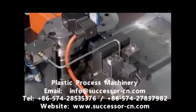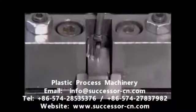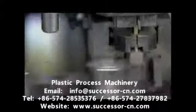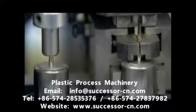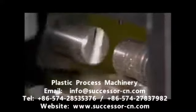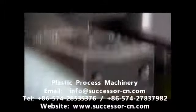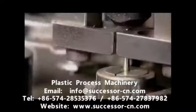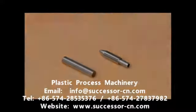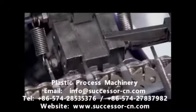High-precision machines progressively shape the pen's tip out of stainless steel blanks. The equipment drills a 1 mm channel through the blank, then in quick succession fashions the tip into a cone, cuts five tiny ink flow channels into the ball socket, and seats a 1 mm diameter stainless steel ball in the center. Another machine then inserts a finished tip in each ink-filled tube.